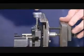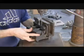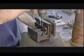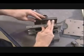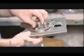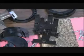Then they secure the parts on a fixture and drill holes into the gear mechanism. Next, they insert roll pins to hold the parts together. The coin discs, if properly assembled, will spin freely. Now workers can assemble the coin dispenser discs and gears.